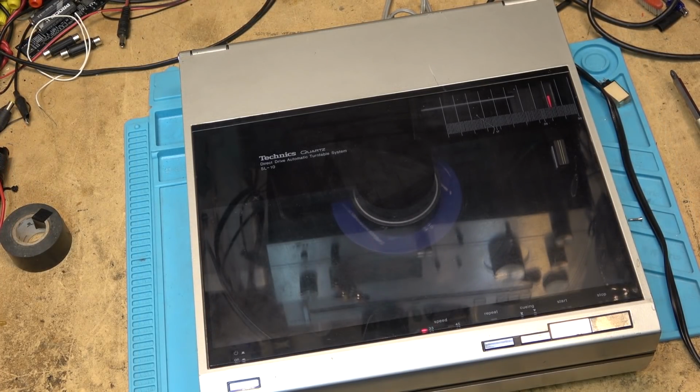Okay, the record is played through now. This is like the third time I played the record through. It's playing it through flawlessly, beginning to end, and that motor was a bit noisy when I was searching out manually. It seems to have quietened down just a little bit, so hopefully that's not going to be an issue, because I think it's the motor that's causing it. I'm going to let the record play one more time before I get it ready to send back.